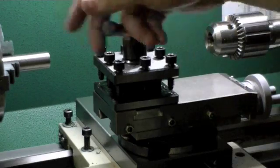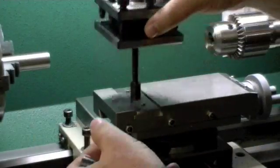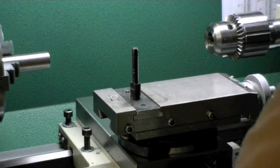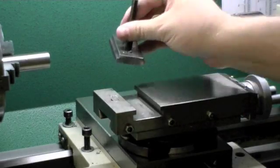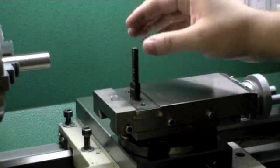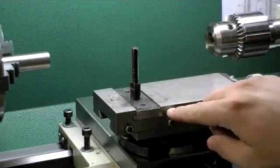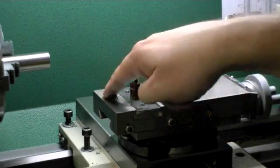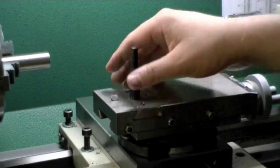It's really simple. You simply remove the existing tool post and set it aside. You'll see that it's got this piece here that slides into the compound. When you tighten down the handle on the tool post, it pulls this piece up and tightens it against the compound. The rest of the tool post rests on the compound, so the pressure is what locks the tool post in place.